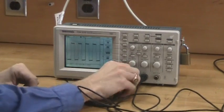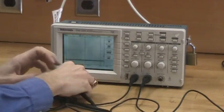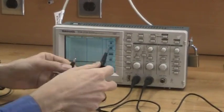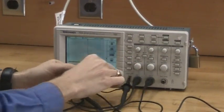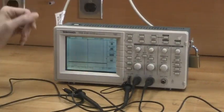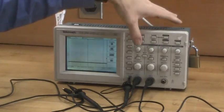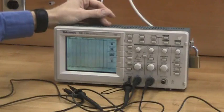Next, after calibrating channel 1, let's go and calibrate channel 2. I'm going to remove the channel 1 probes. Here's my channel 2 probe. Again, the top probe will go to the top pin, and the bottom ground lead will go to the ground pin. Notice that currently nothing is displayed on the scope — don't panic. That's because we need to turn channel 1 off and channel 2 on so we can focus on that.